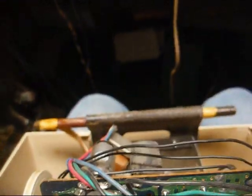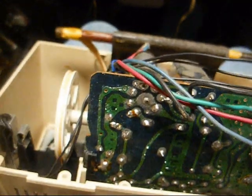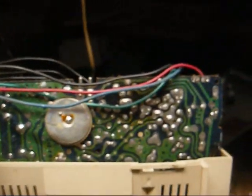Alright, there it is. So you pull the knobs off, remove the plastic dial lens, turn the dial pointer to where it can pull back through the cabinet, and then you unbolt the antenna bracket, unbolt the audio output transformer, release the 2 plastic clips, and the chassis slides back.